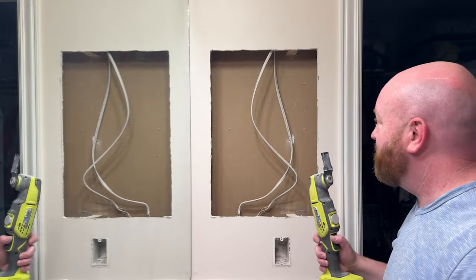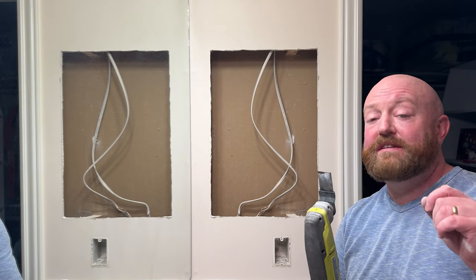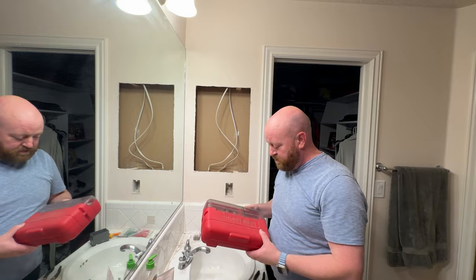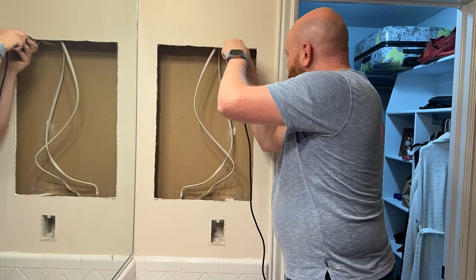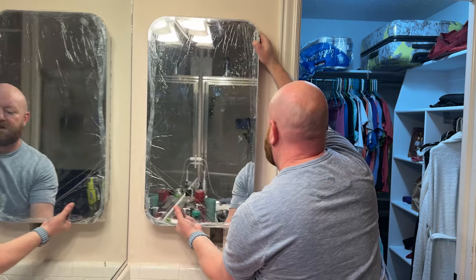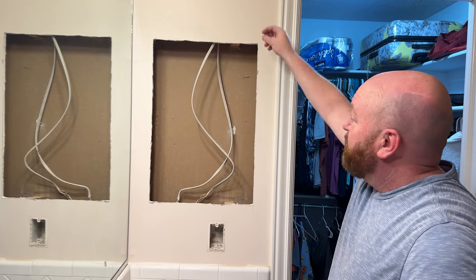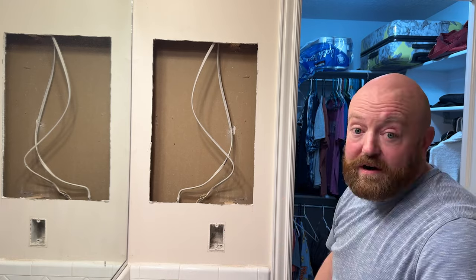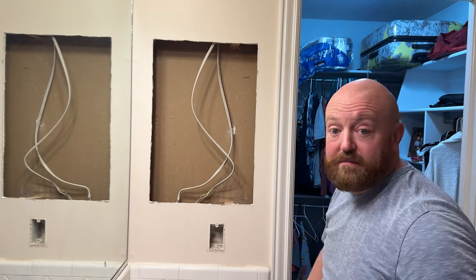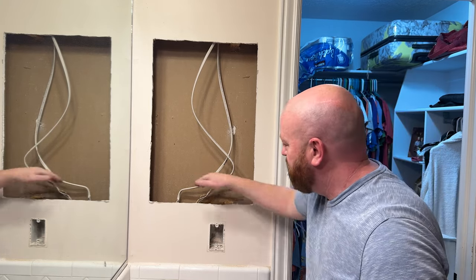I'm having a harder time cutting the wood — I'm remembering that I broke off about 75% of the teeth on this saw when I was trying to cut a screw earlier. Another option I have is a Dremel tool. My next task is to cut out a hole for the junction box, wire it together, run the new wire down, rewire that outlet, and keep in mind the framing — keeping the sheetrock secure and the medicine cabinet firm. I've also got to drill a hole if I'm going to put a board across.